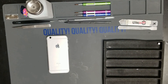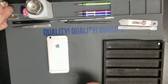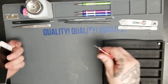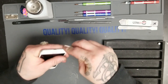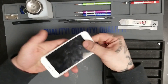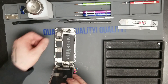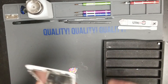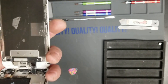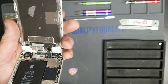Easy way to identify an iPhone 6s: there's going to be an S in a box underneath iPhone. We're going to start this off the same as we do a screen replacement — start with our pentalobe screws, crack the phone open. I use these flat tweezers and a pick. I've seen other repair techs use heat and baseball cards; this is just a method that's always worked best for me. Super crusty in here. This phone has been dried out for a while — they used rice, pulled all the moisture out, left all the minerals. You can see the top of the phone was most affected; the water gets behind that backplate like a vacuum.